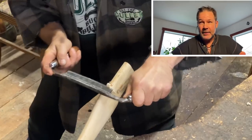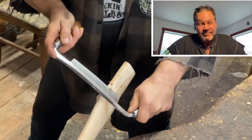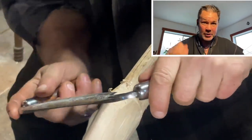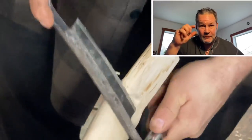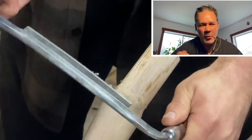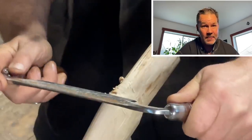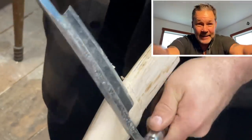We're dropping that. This handle was designed for just a basic, like one of them regular old Chinese heads, or like a Dayton or a Michigan pattern, and it was designed for a flat top. That's it. We're putting a Tassie on there, which is 3¾ inches or 4 inches. But thank graciousness, on the back of the shoulder there was enough wood where the two segments meet, the curl up at the top and the curl at the bottom, at the shoulder there, that I could drop that. But one wrong scrape, one wrong move, it's over. Just take your time. Understand what you're looking at needs to drop down about an inch. So this worked really nice. This is the intricate work of this job, not the rest of it. It's this one. Let's get back to it, shall we?